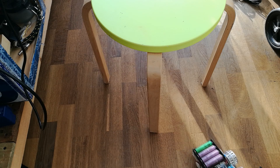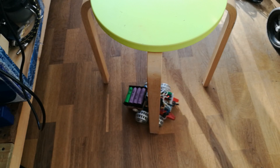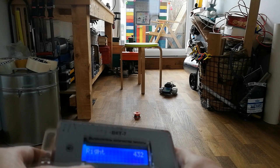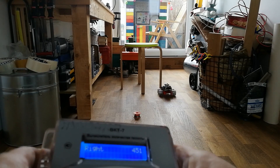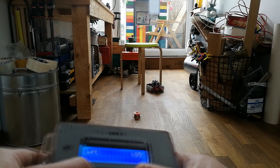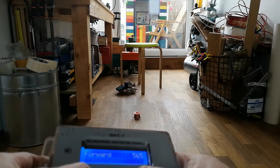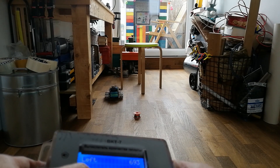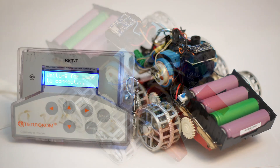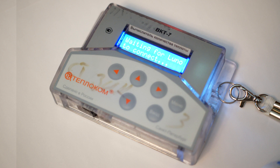Overall, the project was a success. The UDP connection is very stable, and even if some packets are lost there are still enough packets going through to have quick feedback from the car. The only thing that did not work well is the multiple buttons on a single analog pin — sometimes resistance floats and this creates false button detection. Links to the ESP code for both the remote and robot car are in the description, along with a link to the Windows UDP remote control code and a pre-compiled EXE version. Please don't forget to like this video and subscribe — this motivates us to make new videos.